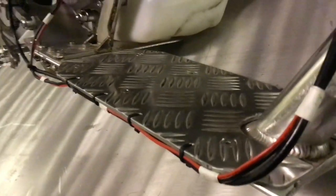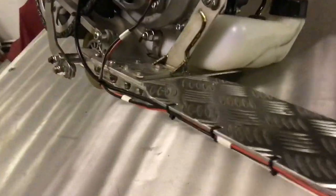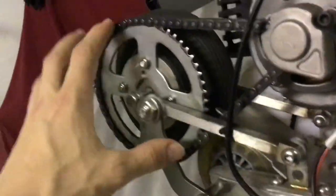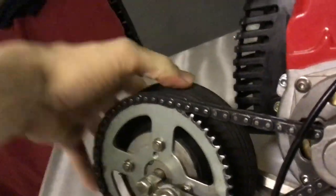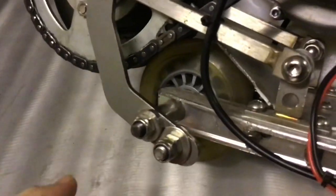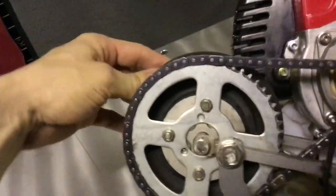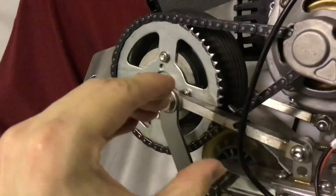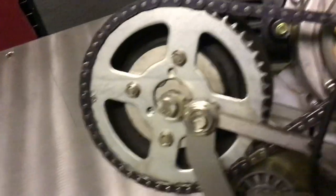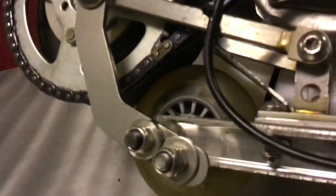You can see the grip plate better — just bolted on the original deck. And it's maybe good to mention how the system here works. I start with a flat tire, release all the pressure from the tire, then I loosen these nuts and press it down onto the smaller wheel, and then I tighten everything up so it's nice and secure. Then I put pressure inside the upper tire and it really pushes onto the tire. This tire holds very much pressure — around 90 pounds per square inch. It's a lot of pressure and it has never slipped.